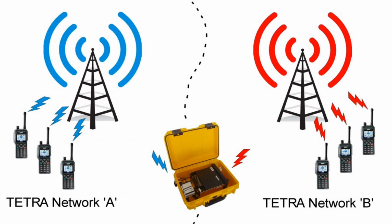Once it's there, you can mount it on a wall, a mast, or a pole. But key thing is, you always need access to the bottom for servicing. Then it's time for connections. Grounding again. Power supply, RF antenna, GPS antenna, and the site link cables connecting it back to the main network. Really, all these physical steps, they're about protecting the system against, well, everything, from lightning down to making sure a connection doesn't wiggle loose.